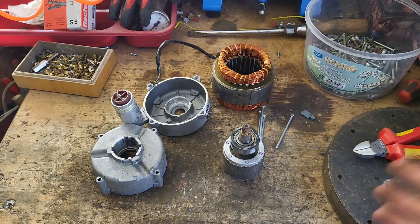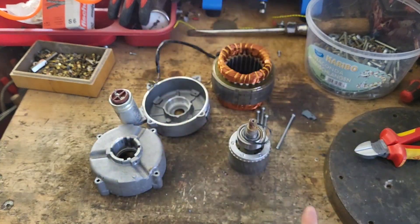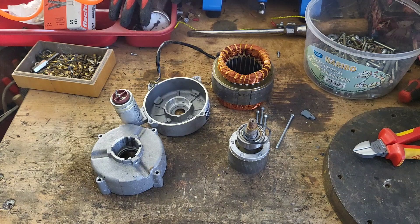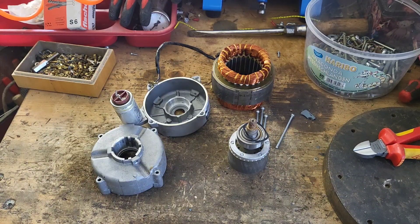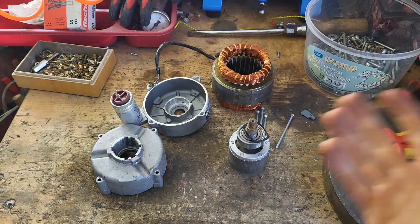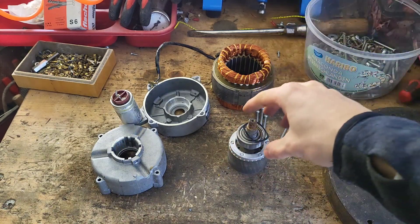So that's the other one done — that was way easier. We've got this one apart. There's a little motor core and there are the two pieces of aluminum. I'm going to leave the capacitor on there because the scale really doesn't care — it's made out of aluminum. But we've got the nice copper stator. At least both stators were actually copper — that's awesome. You don't really find aluminum stators that often. Usually these small motors don't really have aluminum stators. Aluminum stators aren't very good — they burn out very quickly and are just not very quality stuff. People are using them less and less as time goes on.